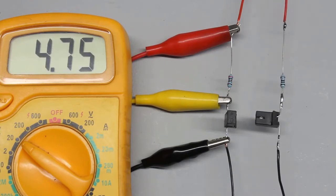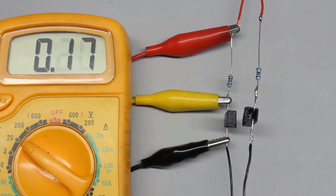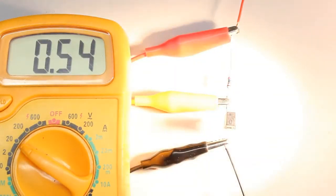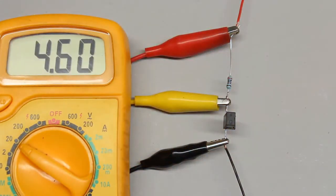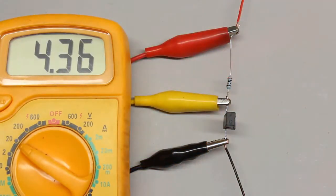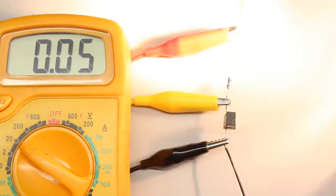Consequently, the voltage across the emitter-collector line drops to almost 0V. Note that the light emitted by the filament of a bulb has a high portion of infrared light. If the phototransistor is exposed to that light, the voltage drops to 0.2V. Same is for bright sunlight. That's why the photoelectric sensors eventually have to be covered when operating in bright environmental light.